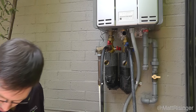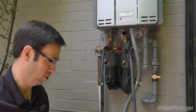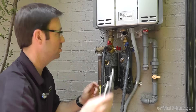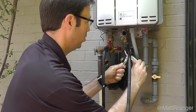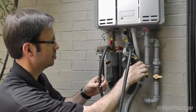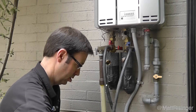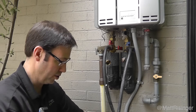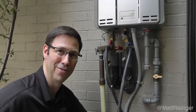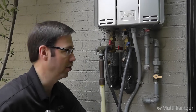That's it. Now let's plug the pump in and let it run. We had a little bit of rust on the fitting, so we tightened it up until we got a good seal. Now we're pumping real good. We want to let this run for about 60 to 90 minutes — a minimum of an hour, hour and a half is probably a little better. All we're doing is recycling that vinegar through the boiler to get any scale off of there, and then we're all done.